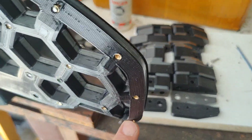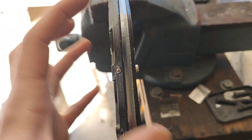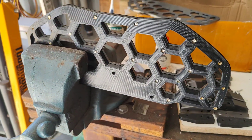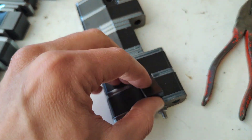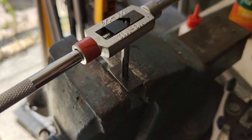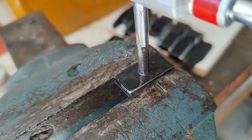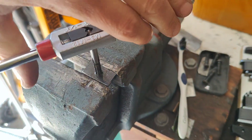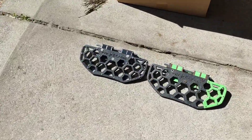M3 by 12s are being used for the outer edge bolts. I'm having a hard time because there's a lot of stretch in these two printed parts. Got to make sure my printer doesn't overheat and stretch. So we've got our plate with temporary bolts holding it together and now we're tapping threads — this is hard work. It was a 4.5mm hole that I drilled out to 5mm and tapping to 6mm, so just a slow process: quarter turns and then backing off, but you get a nice cut.